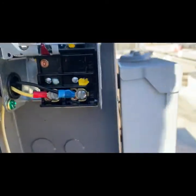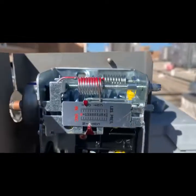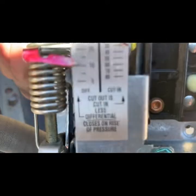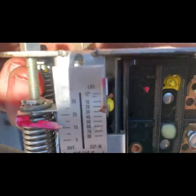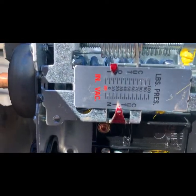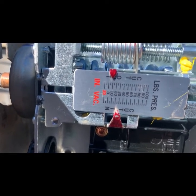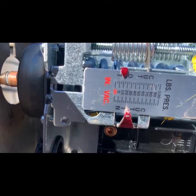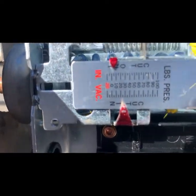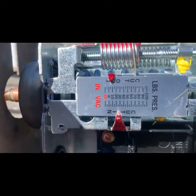This one is slightly different from a setup perspective. The old one has a cut-in and a differential — cut-out equals cut-in minus differential. But this new one is even easier: where do you want it to cut in, where do you want it to cut out? So when the solenoid opens and I rush to 25 PSI I want it to cut in, and as it pumps down, right now this is set to 15 — that's too high. We're going to dial this cut-out down to 10 — it's a cooler so it should never be running that high anyway.